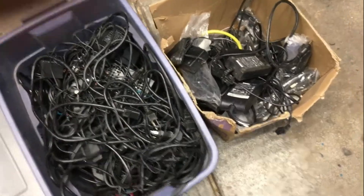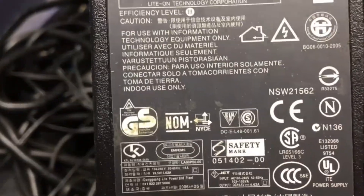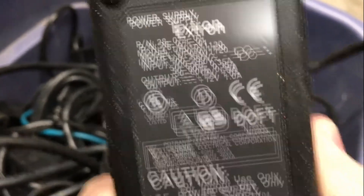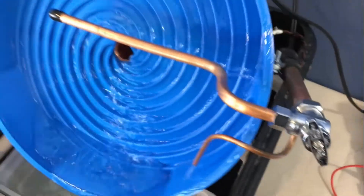The battery charger seems okay but I'm going to look for a better power supply. There's a 12V 2A — that would just barely do it. I found a 19.5V at 4.62A — that's too much voltage. A 12V 1A is too small. Finally I come across a 12V 3A — that should be just fine, giving me an amp of overhead. I've got it hooked up and it's running at 1.76 amps instead of 1.8.